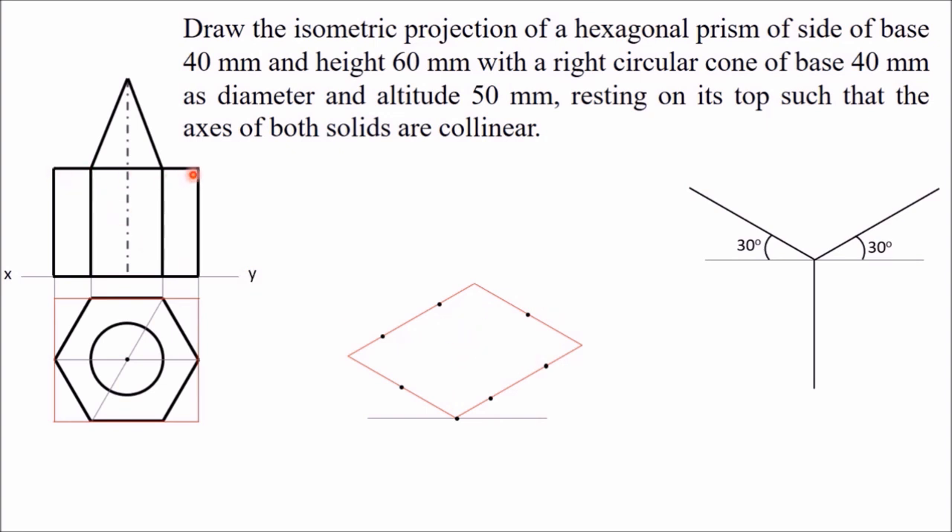At the top you also have this hexagon. To draw it, you again need these six points. The height is directly given — hexagonal prism height is 60 mm. From each of these six corner points, draw vertical lines of 60 mm length. At the end of these lines you get the top six corner points of the hexagon. Join these top points. Now join the bottom visible side lines — this one, this one, and this one. The remaining lines are not visible, so I am not joining those hidden lines.